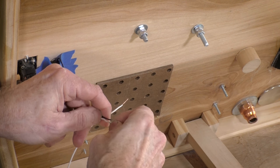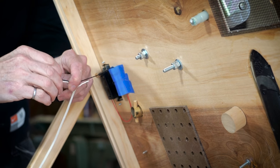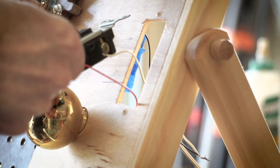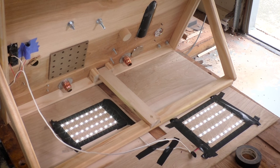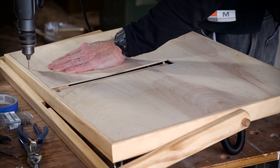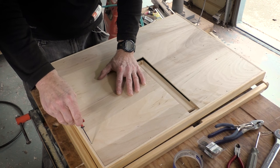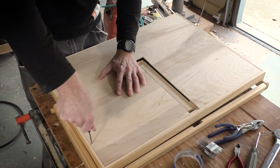Now I'm back at the battery - this is a 12 volt battery. I'm connecting the negative lead to the negative terminal of the battery, using a little bit of solder to make sure it stays connected, then connecting the positive lead to the switch. I'll give it a test and it works! I'm screwing the back into place by pre-drilling the holes and using a gimlet to thread them. I'm using screws so the back can be opened whenever needed to change the batteries for the LED lights as well as the cordless phone.